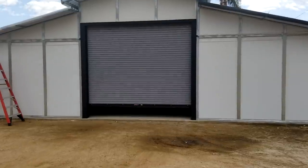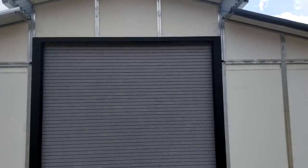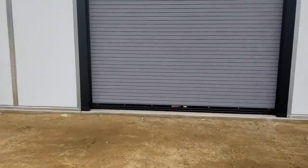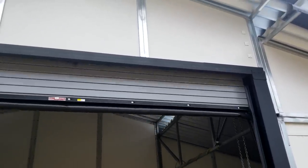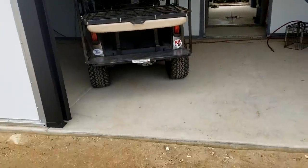You can see my black trimmers kind of match all the other hardware on the roll-up door — it's a pretty slick door. I picked gray; I could have picked white or gray, but I like the monochrome so the gray, black, and white look pretty good together. It's got a door seal on the bottom like a rubber inner tube type bump seal, flap seals up the side, and across the top it's got a brush seal. That gives me a 10-foot-1 high by 11-foot-1 wide opening.